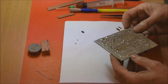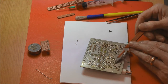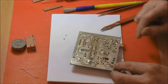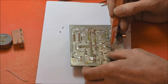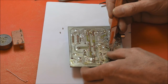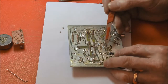So we find a patch where that lived. Find its home, which is round here. There are 3 contact pads there, and then a collector or heatsink kind of pad there. If you were to solder that, again, it's mechanically placing it where it needs to go. Sometimes just a cocktail stick can be quite handy in keeping it in place. It's picking a lead to solder to tack it in place. It means if it's not quite where you want it to be, you've got a bit of chance to move it.